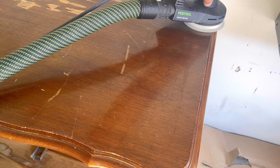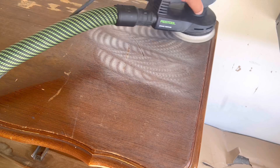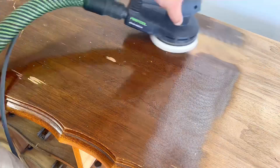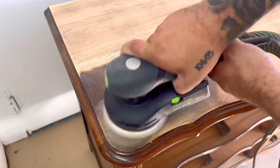Typically I'll use a stripper to strip the top down before I sand it, but sometimes stripping leaves too long a process of waiting for it to dry. So I just grabbed some 80-grit sandpaper and started going to town, but one thing you want to make sure is that you stay away from the edges as much as possible because you don't want to blow through that veneer. Once I'm done stripping the finish off the top with 80-grit, I go over with 150-grit and follow it up with 220-grit to get all the swirl marks out.